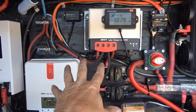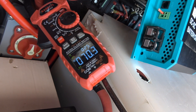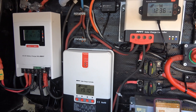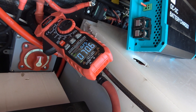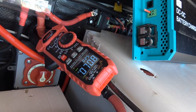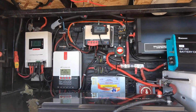Next I switched over to supply the bigger battery bank with both the SRNE solar controllers and the DC to DC charger all charging simultaneously. I noticed a slight drop in amperage from that charger — showing 39.6 amps — for a total of about 70 amps combined. Chargers can affect each other when all charging at once due to slightly different voltage values and different wire lengths causing voltage drops. Still, going down the road and putting 70 amps into my battery is pretty good. With just solar from those two controllers I'm getting around 36 amps, confirming some loss when running all three at once.